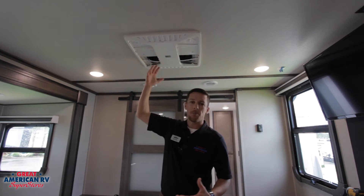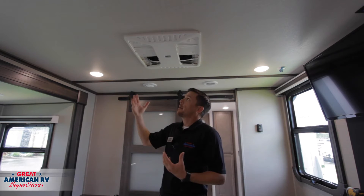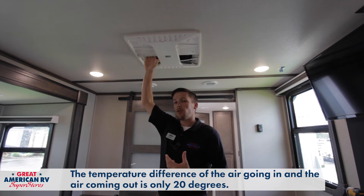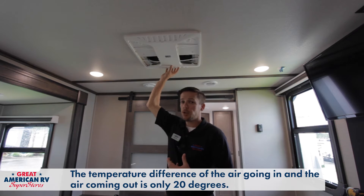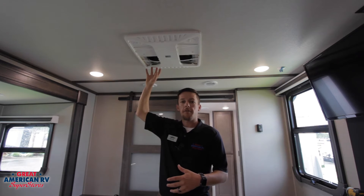Let's touch on a little bit of diagnostics now that we've covered maintenance. Is our AC not working? Let's define not working — is it not cooling? If we have air blowing out and everything seems okay but it's not cold air, keep a couple of things in mind. These air conditioners only have a 20-degree split. That means the air being pulled in to our return versus the air being pushed out is only going to be a 20-degree difference. So if it's 100 degrees or more inside this unit, you're only going to get 20 degrees less temperature coming out of the vent.